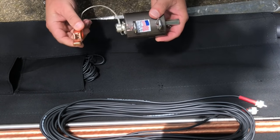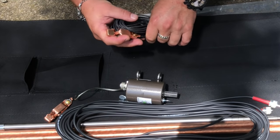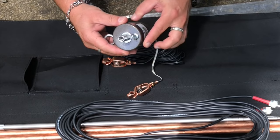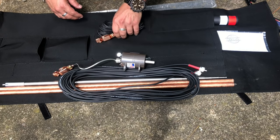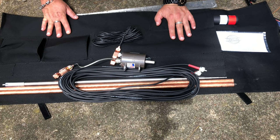The transformer actually clamps to the ground rod, and the antenna kind of just sits on there. It's a really unique design. There's a bit of wire here — this is not a counterpoise wire, this is actually part of the antenna. The whip connects here, and then this wire connects to this bit here, so it's actually kind of set up like an L. That's it. It's very, very simple. Let's pound this into the ground — I'll show you how easy this is to set up, and then we'll throw it on the analyzer.